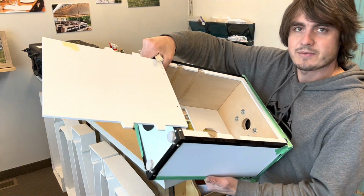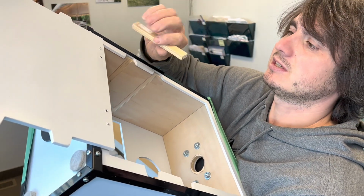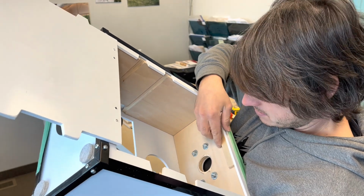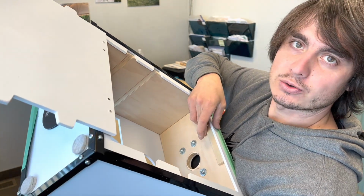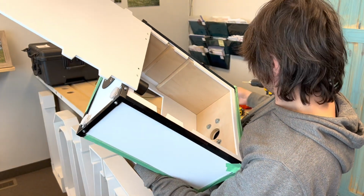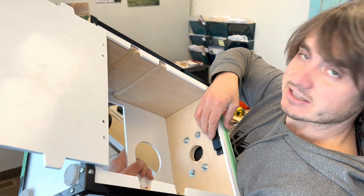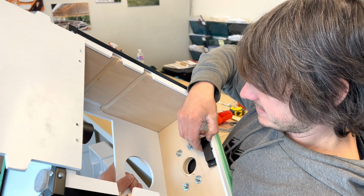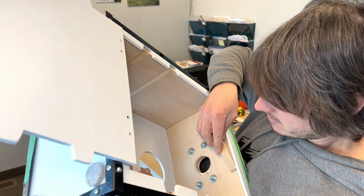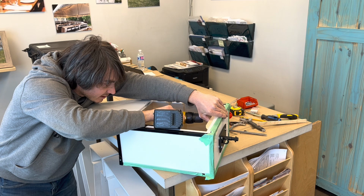Okay, so to get a good angle out there, we're going to put this piece of scrap that I found, looks like 1/2-inch plywood. I'm going to put it right there, drill 2 pilot holes, add some screws, and then put this magnet lock on top. Otherwise it'll sit like this, and then the magnets won't have room to access the other magnets, so it needs some sort of riser there. Obviously I don't want to go out on the opposite end.